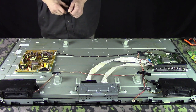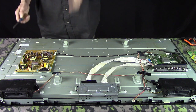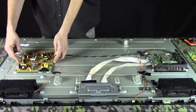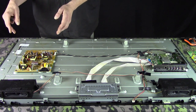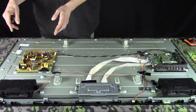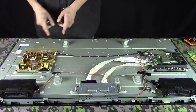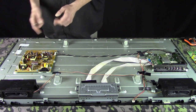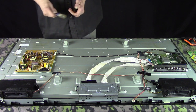When you remove this board, you can see there are some capacitors. Take your time, grab it by the edges, lift it off, and then put it on something that is not conductive. Because if it is something conductive and these capacitors are charged, it's going to short them out, heat it up, and you could start a fire.